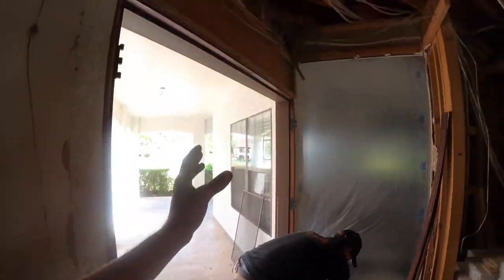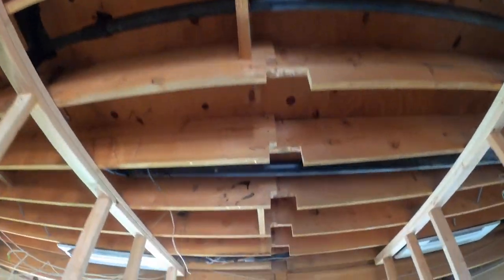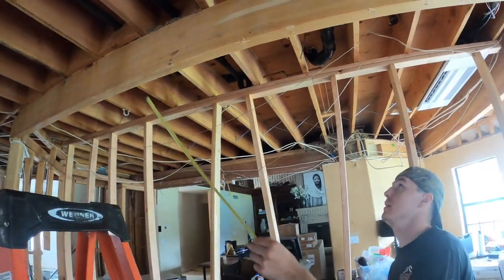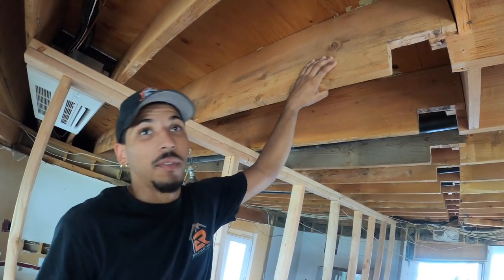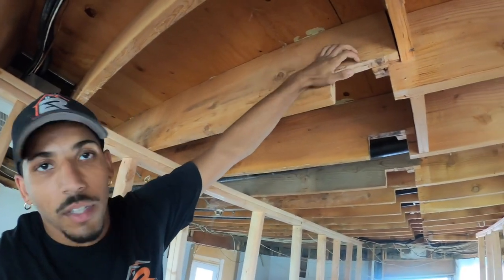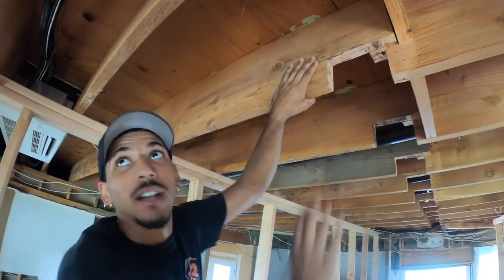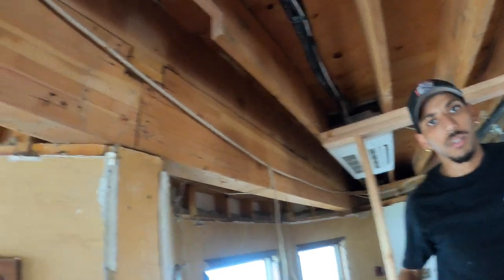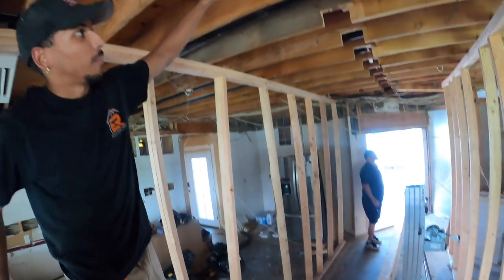Get it all cleaned up — beam's about to be transported in. All the rafters are cut. Our old beam, as you can see in the previous videos, was 11 inches. This new one is going to be 15 inches. You see these notches in the rafters along the ceiling — those were made so that the beam can slide in snugly, and when it lines up, both sides of the ceiling will be flush with no gap anywhere. The beam's here, we've got the lift and the crew — we're going to throw it into place.